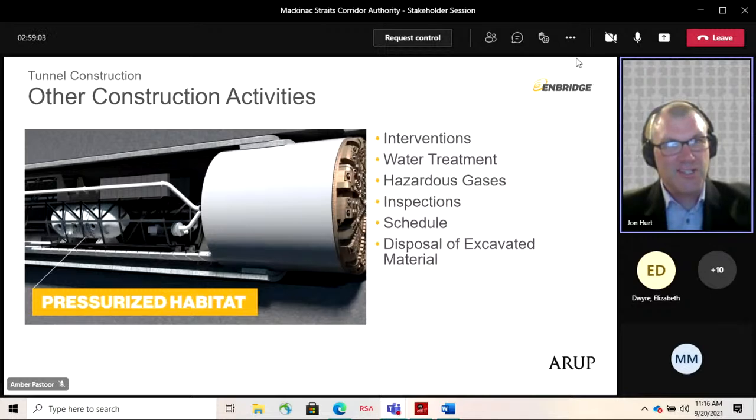So there's established survey techniques for these tunnels, and so typically even tunnels much longer than this will hit their target within an inch of precision at the far end. The way the TBM itself steers is the surveyors will set up a laser beam in the tunnel, and they know the alignment of that laser beam, both in plan and profile. And the TBM has a guidance system that takes information from that, and that's used for steering the TBM. And then there's various survey techniques to get the survey control down into the tunnel. Obviously, it's a long, narrow pipe, so it's a bit more challenging than being in the open, but it's established procedures. Great, thank you.